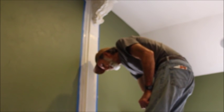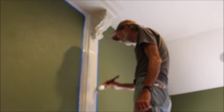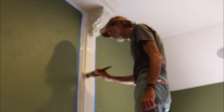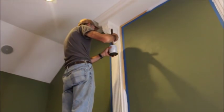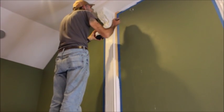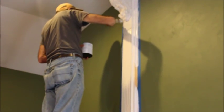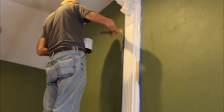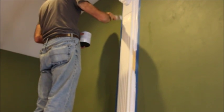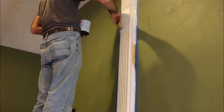I'm up on top of the ladder. We've got everything taped. We're actually doing it with a high gloss brilliant white paint — we're going to be putting several coats on it to make sure we get a good finish. As you can see I've moved over to the other side now and I had a little mishap there — a little bit of white paint got on the green, but luckily Wanda brought me a damp rag and we were able to get that off before it became a problem. We're finishing up the top part of this column. We always start at the top and move down when we paint because it's a lot easier to move down than up when you're painting. It's hard to do this because I'm standing on the very top of a ladder — the ceiling is so high.